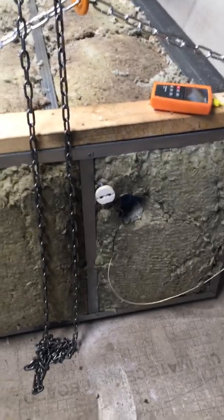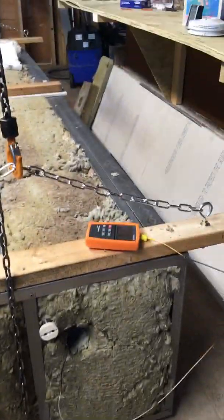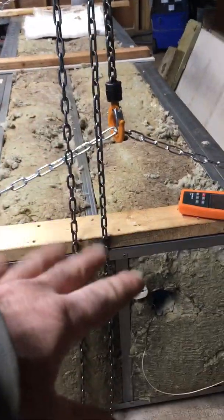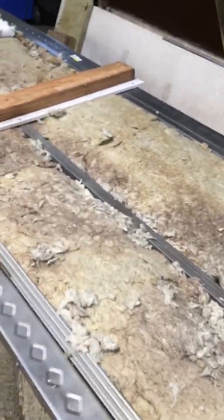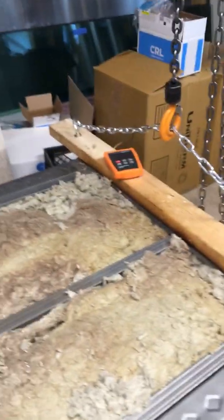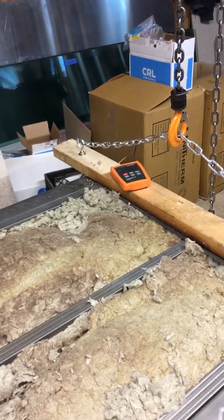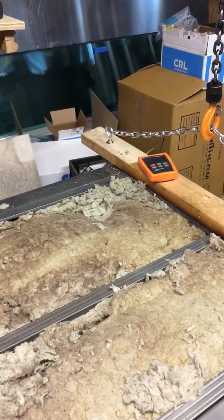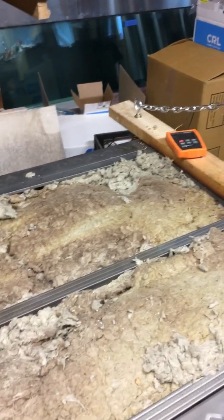So it's not really a true measurement of the heat in that oven, because when the hot air is flowing by it, it's giving you one reading. When you shut the burner off, the temperature drops immediately. It means that's really not the oven temperature, because the oven's got to sit for a while with that temperature in there, and that threw us. We tried to cut a piece, it wasn't annealed. It told us we were at 900. We held it there, and then when we shut the oven off, we realized that the oven wasn't at 900 because the temperature dropped immediately, and dropped a lot. So a couple hundred degrees. That's a big fluctuation when you're trying to get an accurate temperature to stay.